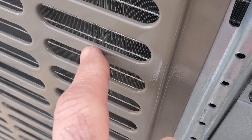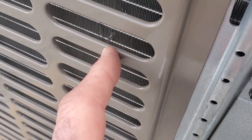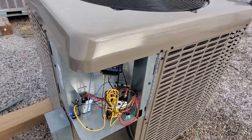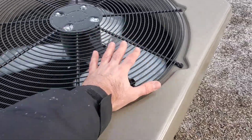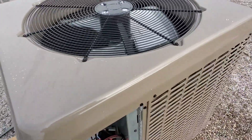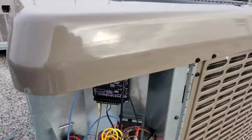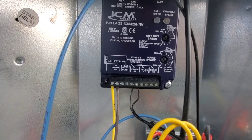Here is where I'm going to try the probe — this is the top one-third of the coil, put through the fins as per the instructions since there's no U-bend on this micro-channel coil. On a preliminary check it's installed and running: the fan's not going very fast, actually going very slow, and there's some heat rising out of the top — that's sort of what we want to see. I need to find out if this fan motor is sleeve bearing or ball bearing because it matters for the settings, and you can see there is a ball bearing and a sleeve bearing setting.